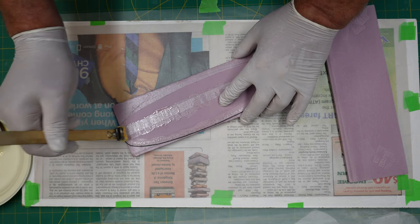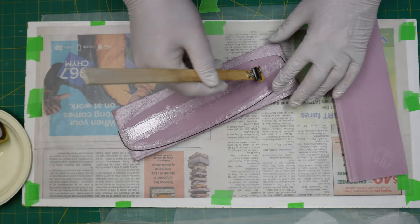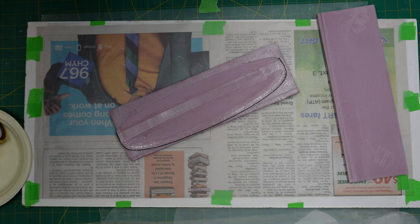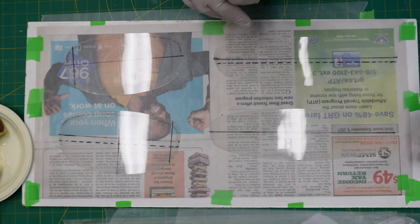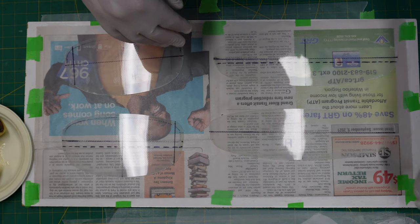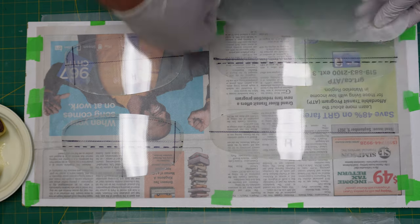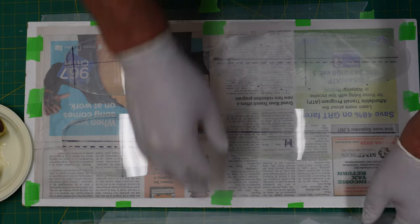I should mention that on the colored version I did apply some tint to the epoxy resin and it really had no effect at all — it didn't affect the epoxy as far as strength or anything else, it just gave it a white color. Here are our mylars — I've waxed these with a wax release, about three coats.